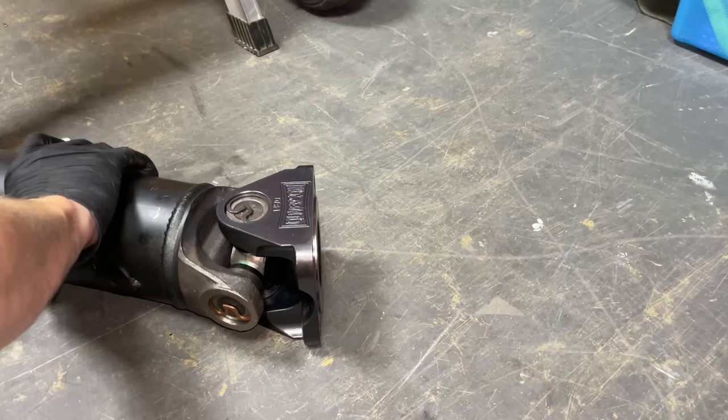So now, hopefully it's going to work. We put some more pressure in the shocks, and that's going to give this side maximum travel, the other side maximum down, and then we can cut our arches out, or the fenders. So we just cut a little bit out of here. I didn't really want to cut any of this off, because we're going to harm the face. But we've got no choice. It's either that or moving the body further forward, and if we move the body further forward, that's going to hit when we do moonwalks, like those wheelies. So anyway, next we've got to steer it to see how far we can actually steer.